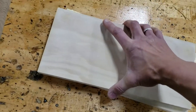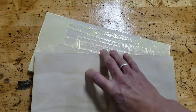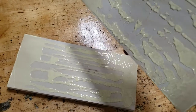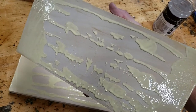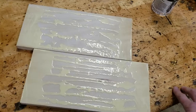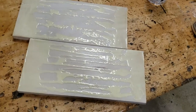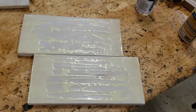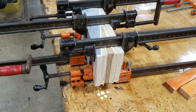I usually do a little twisty twist and then try to pop it off and see where the glue really grabbed. You can see it didn't really grab in the middle — chances are my board's a little humped. I'd have to put some big clamps on there and add more glue. When gluing, give yourself enough — you don't need so much that you drown in it, but you need enough for appropriate surface area and proper coverage.